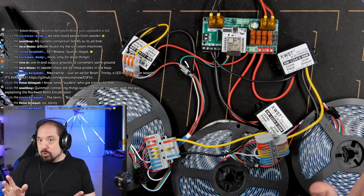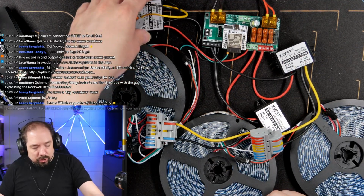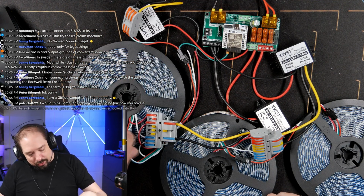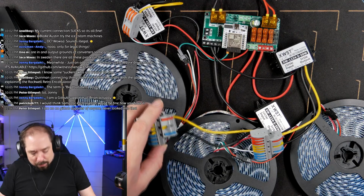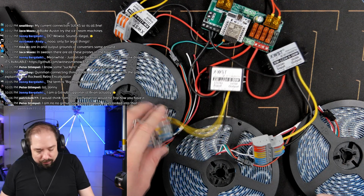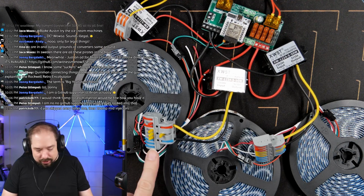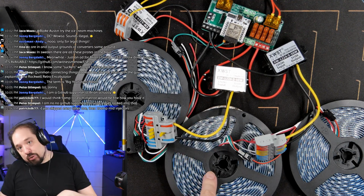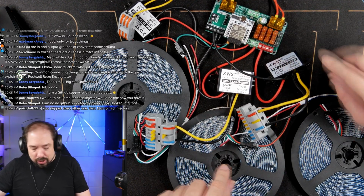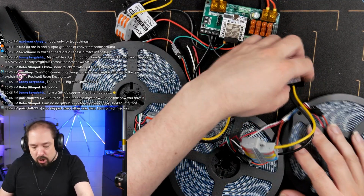Right, so to resume, we have an initial edge connection going to a 5 amp block, which is then fed into this LED strip here. 300 LEDs later, ws2812b. We have a middle connection, which is being fed through this 10 amp block, which is then feeding both these strips with the power injection wires, and it's connected, so everything there is connected. Then it goes to another 300 LEDs. Then we have another 10 amp middle injection. We also have the LED strip connected, so all the positives and all the negatives, they're all connected.